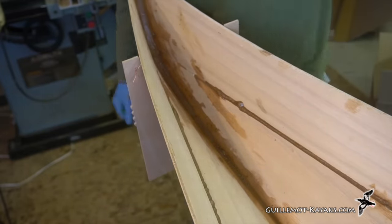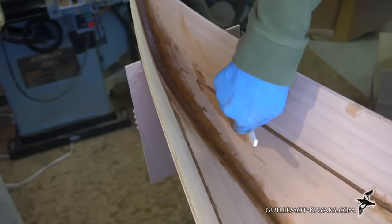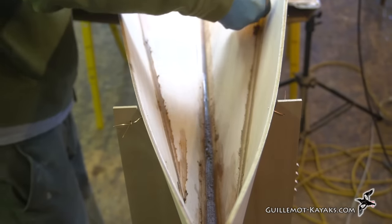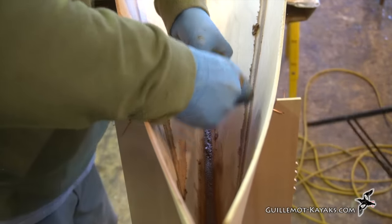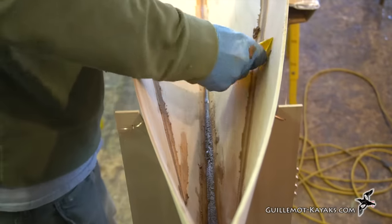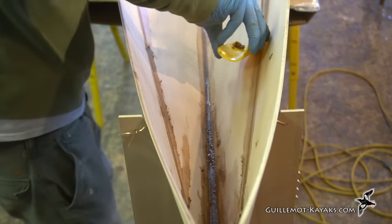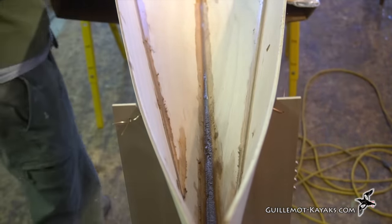Spoon the side seams as well. The temptation to skip the alcohol and just use a finger will just rough everything up again. Clean up with the spatula. Running into a dry hardened spot — just smooth it out as best you can.